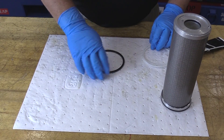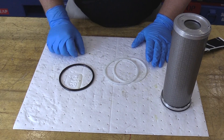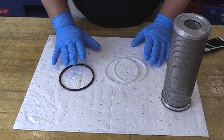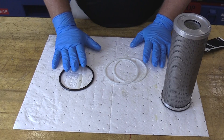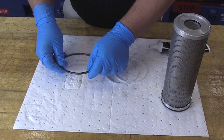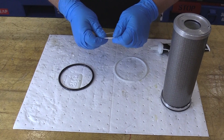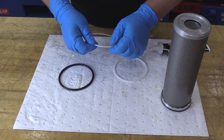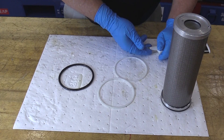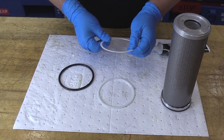Now we have an O-ring and the two backup rings for the filter housing. These are going to go up inside the filter housing, but before we do that, we want to make sure they are lubricated with white petroleum jelly as well — including the backup rings. The O-rings and backup rings are both one-time use only, so when we take this assembly apart, we need to ensure that we are using new packings and backup rings.